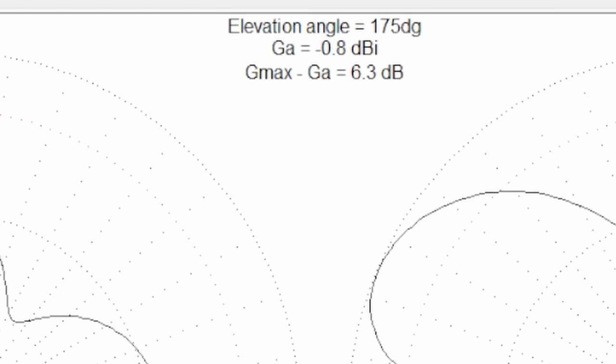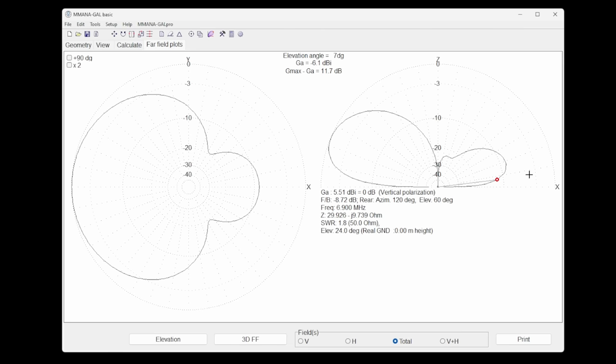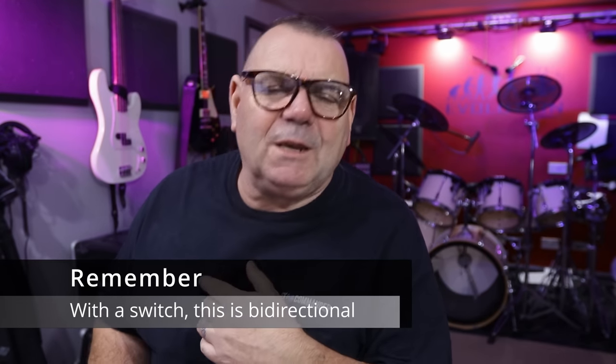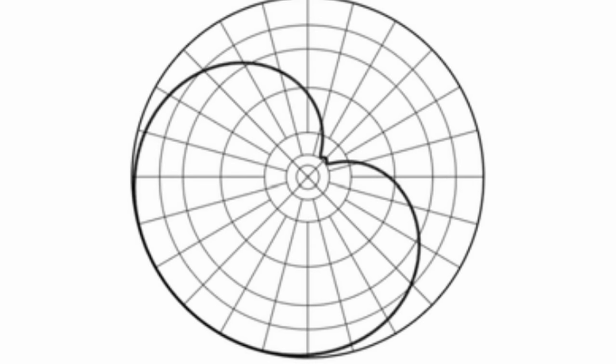So we are nearly a dB better in front of back gain. And we were at minus 11, and we're now at minus 8. Let's say there's 2 dB in it. 2 dB is a fair amount, though, if we're doing all this work. You'd want to get every bit out of it. But the plots that I've seen on the internet look a bit better than this, so I don't know if it's my modelling. I've got no idea.